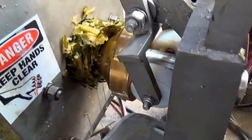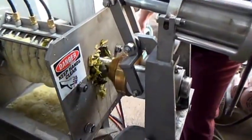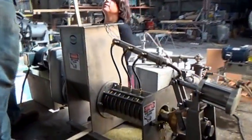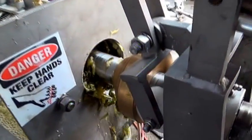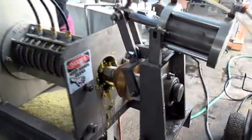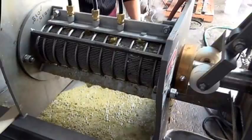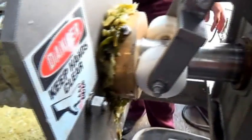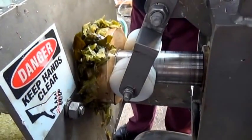We're emptying the press now. We're going to try grinding this material finer to see if that makes it work any better — though I don't expect it to. We've now shredded it finer and we'll give it another try just in case. We're getting a flow through the screen, but very low capacity. It seems to be channeling a little bit and coming out as rotating foam. Grinding finer helped somewhat.